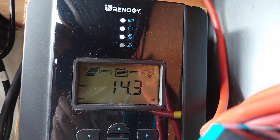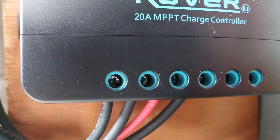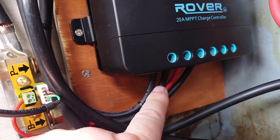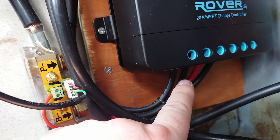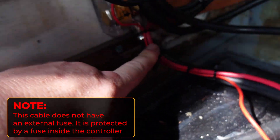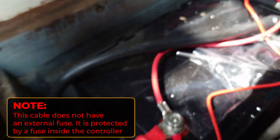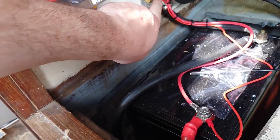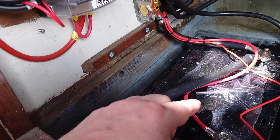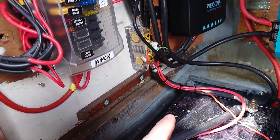Adding the controller to the rest of the system is straightforward as well — just mounting the box close to the batteries and terminating two input cables and two output cables. The red wire from the bottom of the controller — note the two supplied cables are both black, which is a bit stupid — the red one comes through here and directly onto the battery terminal. The other one is the power for the shunt. They are therefore before the isolating switch, because you want your batteries to be charged continually whilst the sun is shining.